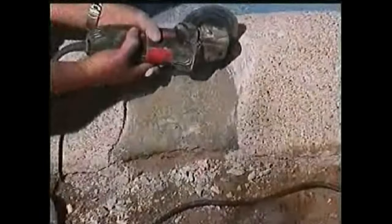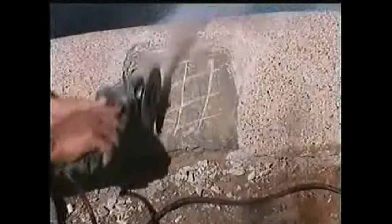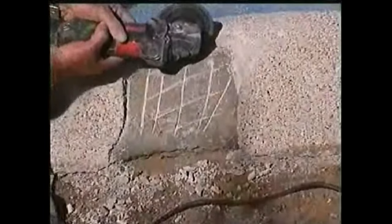We find that the shotcrete rolled bond beam surface is too smooth, so to ensure a correct adhesion, you should either saw cut grooves as shown or use a hammer and chisel to nick up and roughen the substrate surface.